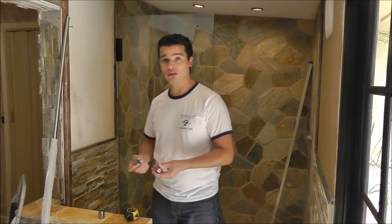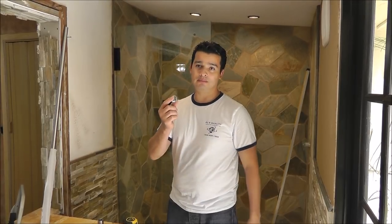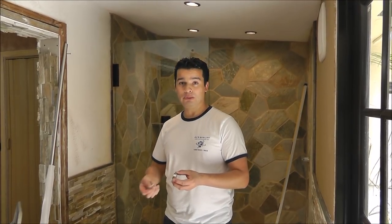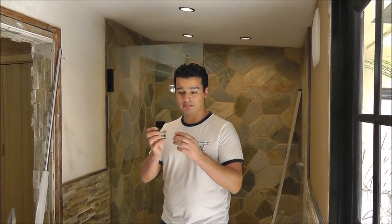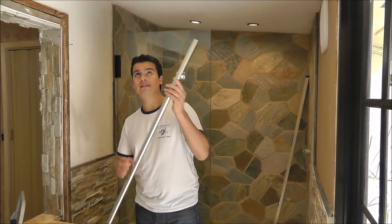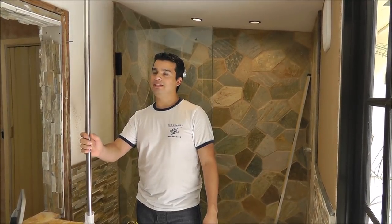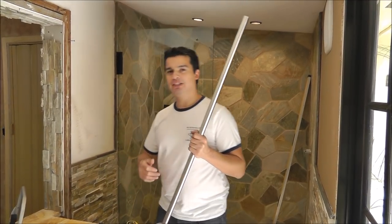I still have another one, so it's actually double. It's very simple — this part goes to the wall with a screw through it, the same type of piece on the other wall. So I have 9/16 on each piece, by two is one inch and one eighth. I'm going to add a quarter inch to play with the bar inside the support. So I'm going to cut 61 inches minus one inch and three eighths. I'll show you once I finish cutting.